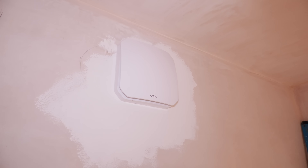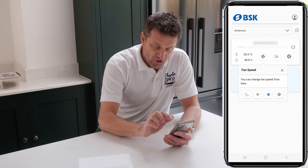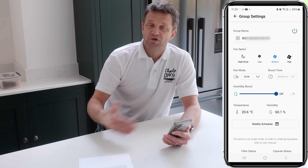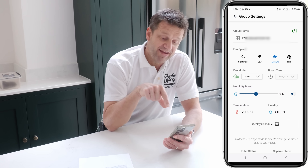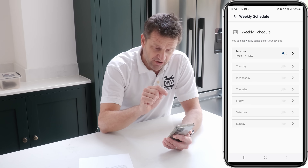With the infrared remote you can activate night mode, choose from three airflow direction modes, set your humidity levels, and choose from three fan speeds. As is so often the case, you've got a lot more functionality when you delve into the app rather than relying on the remote control. You've got the three fan speeds and night mode, plus the ability to change from exhaust to supply to cycle mode. Delve into the settings and you can set a boost mode and boost time. You can also set humidity boost so the fan works to achieve a certain relative humidity in the room — I did try it once but when it achieves the target humidity it reverts to exhaust mode and I forgot to turn it off, so I prefer cycle mode. You can also set weekly schedules, which I haven't bothered to do because I haven't needed to.